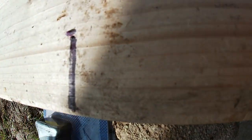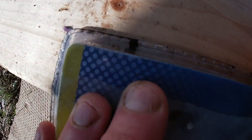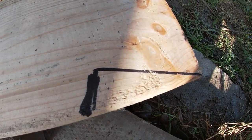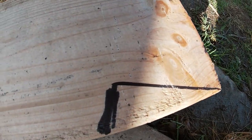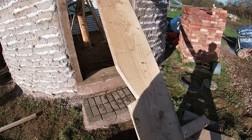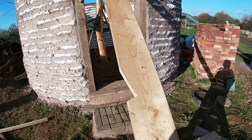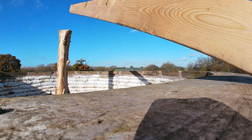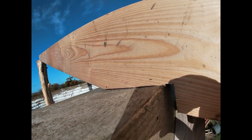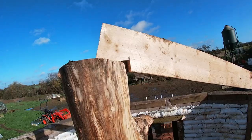Then work out the top of where you want your 90-degree corner to be. You've got that straight line there, then take a square corner, put it on like so, and draw your straight line to the edge of the wood. You'll end up with a shape that's dead easy to chop out and it'll sit flush on top. I already cut this one out — notch at the top, notch here to sit on the outside edge — so I'll put this one up there just to show you it works. And yeah, it's that easy: bottom one sitting on flush, top one sitting on flush.